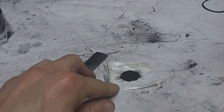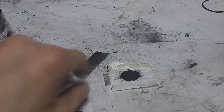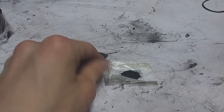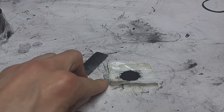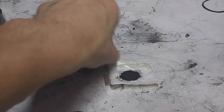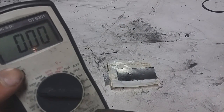The separator used is a polymer separator from lithium-ion batteries. On the bottom is the anodic side: here I have aluminum for the negative electrode, and the electrolyte for the negative section is an alkaline electrolyte — in my case, potassium hydroxide. The pH difference between the two electrolytes is what creates the voltage boost.